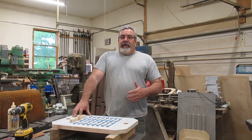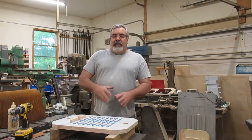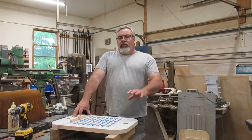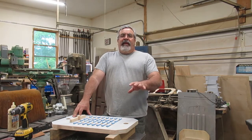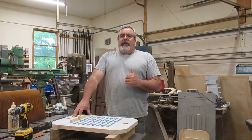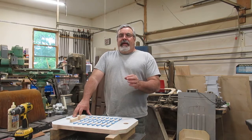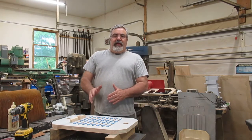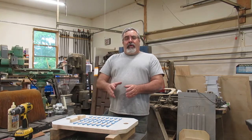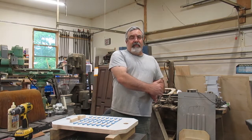It got to the point with them that I said, John Winter used to do this once, and he'd send it out in the foundry, and we'd never see it again. And well, yeah, that's because he overgates stuff. What we're trying to do is make it so that it's the minimum amount of gating, because when you cut this gating system off, you have to remelt it, and you're taking more power to remelt, you're taking power with the extra metal that you melted.